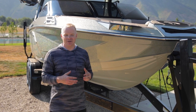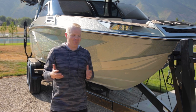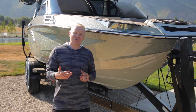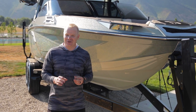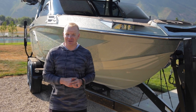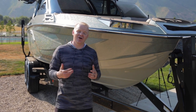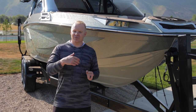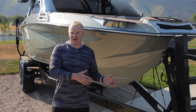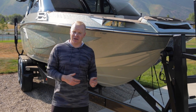If you look at a Centurion RI hull, you notice that it goes from a center point down at the bottom of the hull, and as it moves up towards the sides, the surface area continually increases as it goes up and reaches the rub rail. What that does is when you turn around to pick up a surfer and head back into a surf wave, as the waterline creeps up the hull of the boat, the bow will progressively lift up further out of the water because the surface area and buoyancy increases. That makes it much more difficult to take water over the front of your boat — it's not something that's going to take you as a driver by surprise.